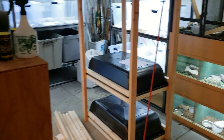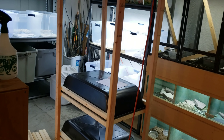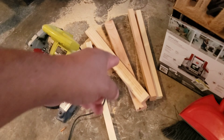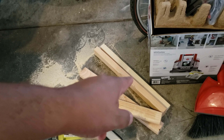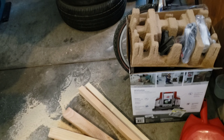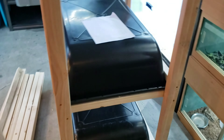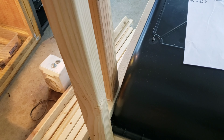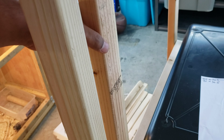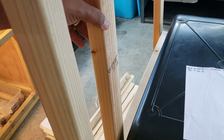I got those 18 inches apart by using a tape measure to get the distance I wanted from each other. But I think I'm gonna make it easier by using these boards. I'm gonna cut them down to 16 inches, and then I'm gonna make like a one-sided frame. I'm gonna cut four of them into 14 inches — sorry, 16 inches — and then put the two by two on top so it'll make 18 inches total.